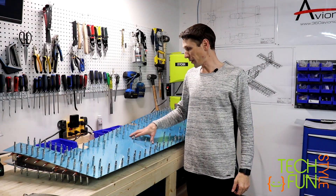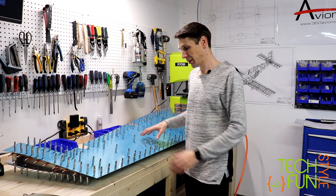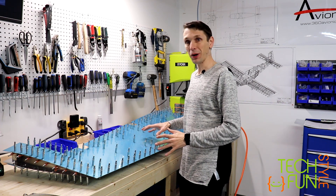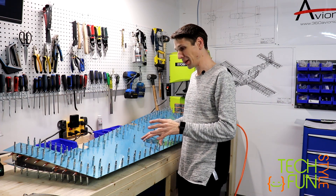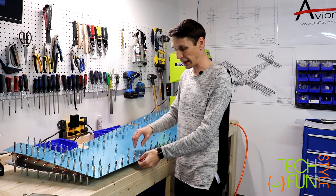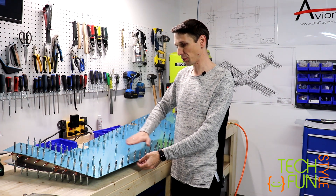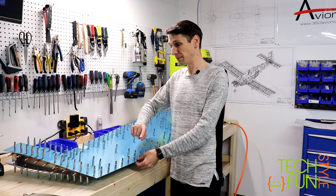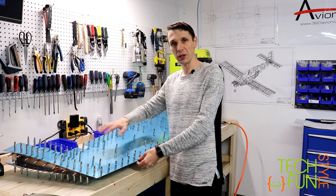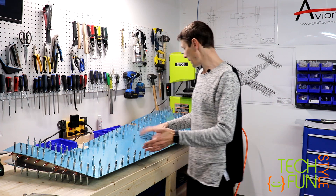The drilling part is now completed — actually the match drilling part. That was quite a big amount of holes I had to match drill. And especially here at the trailing edge, you have to drill it perpendicular — not with the surface of the skin, but basically with the chord, like the middle of the rudder itself. So it's a little bit tricky, but anyway, it's done now.